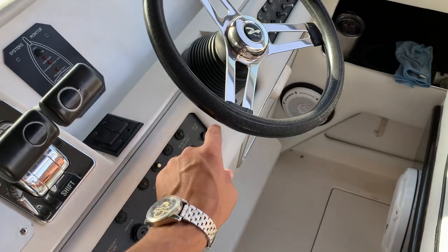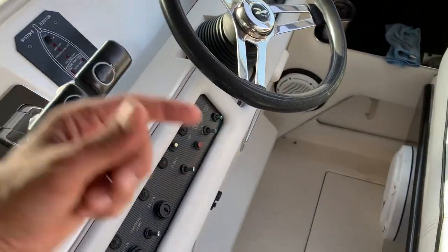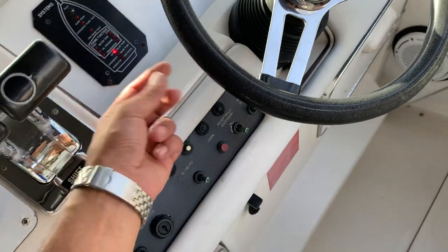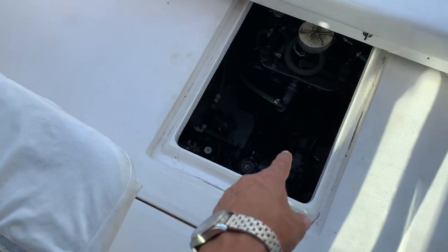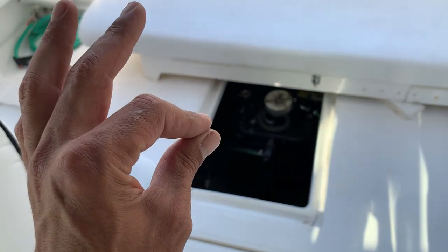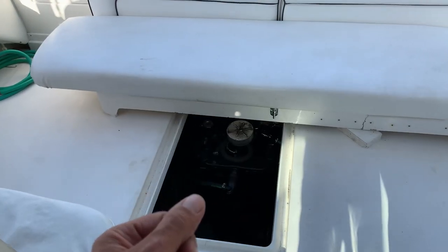To get the problem fixed, I went behind the switch and checked it — I had 12 volts there. I turned it on and confirmed it from there, then went back and made sure both wires were okay, since one goes to the light and one goes to the bilge. My next spot to check was both sides of the float, because one side should always have 12 volts. To find out if the float is working, you just activate the float.